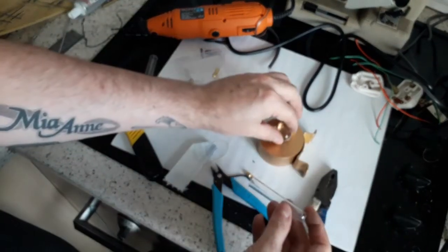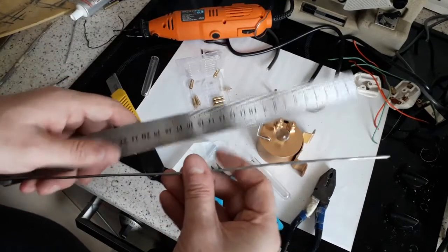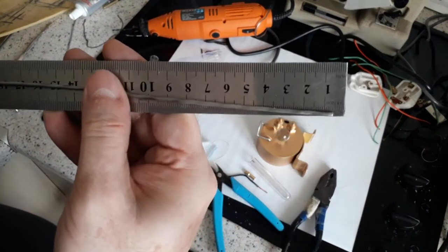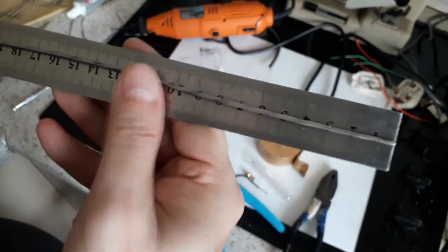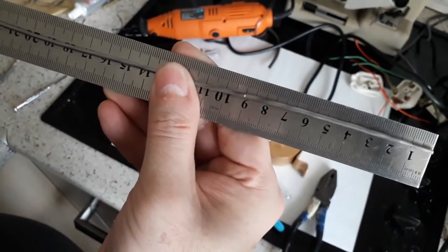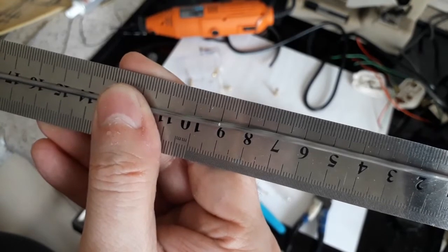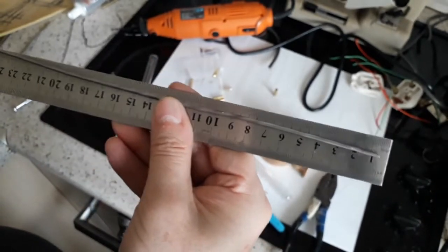Okay, so let's measure it first. I still use inches, I shouldn't, but anything in small distances I'll measure in millimeters because I feel it's more accurate. Okay, where's the mark? There it is. It's exactly 90 millimeters. See the shiny mark's right on 90 millimeters. So I'm going to take maybe a millimeter off that, so just before 90. And then we're going to cut 3 of them.